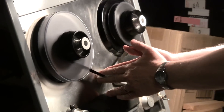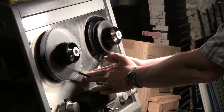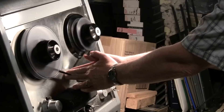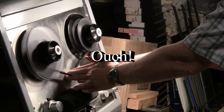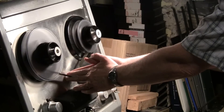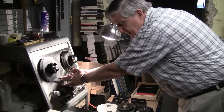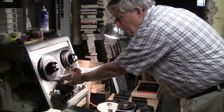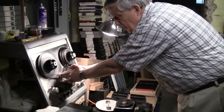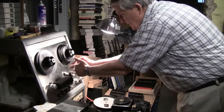With very gentle pressure, I try to do this on every tape at least twice. It invariably helps you find the masking tape splice, the scotch tape splice, or the occasional staple that somebody has done. I keep the head block for the Ampex audio heads there so I can rest my hands on it. This is done by just gentle pressure - I can feel the tension. If it's really sticky I will loosen the tension, but this is the best position to physically feel it.